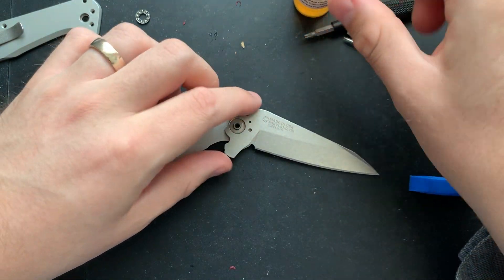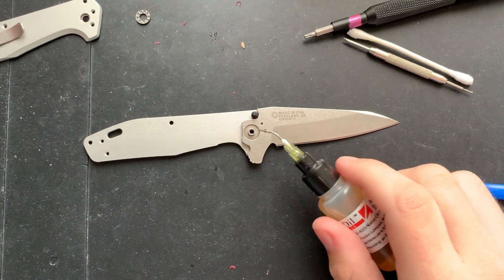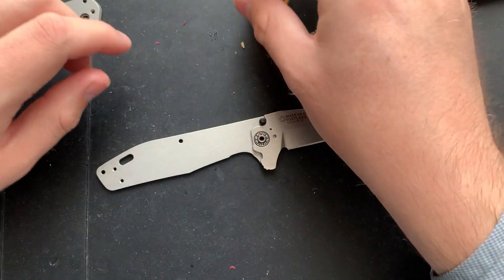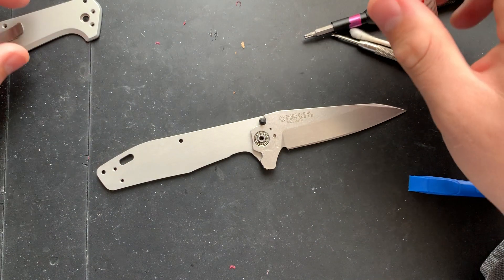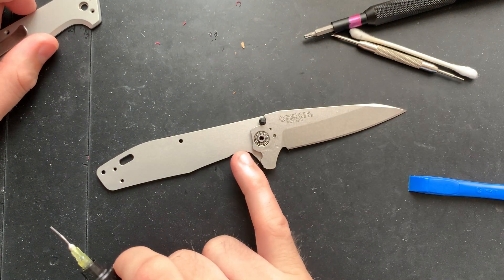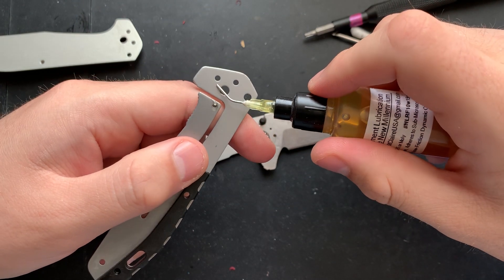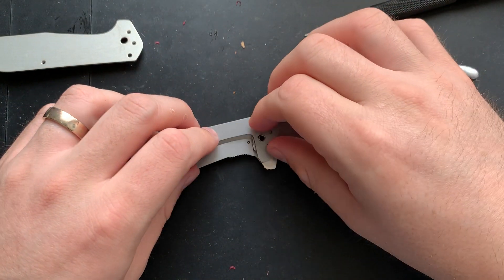Next step is to drop this blade onto the pivot. I'll go ahead and drop a little bit more oil in there — that will serve not only to lubricate the pivot, but also everything else. I will also put a little bit of oil right onto the detent ball path. There is no detent ball ramp here, although the way it's designed it's coming onto it obliquely, so that's probably why. I'll put a little bit on the ball as well as onto the detent track. The knife is now duly over-lubricated.